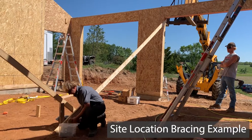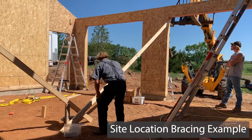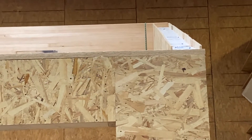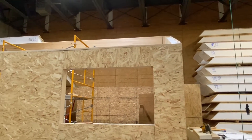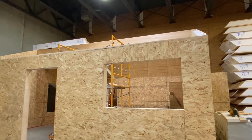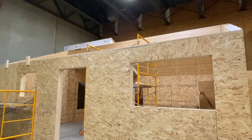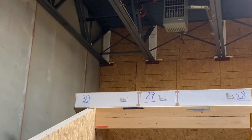We're leaning on it, moving it around, setting panels on it, and bumping into it with the skid steer — so make sure it's straight. Just like standard construction, before you start setting trusses you always string your walls. You'll notice the top plate and cap plate are in place on this front wall and the back wall where the first panels have been set. The top plate is recessed down an inch and a half; the cap plate rim board on the edge extends out to the full width of the panel — six and three-eighths of an inch.